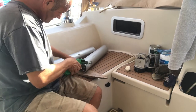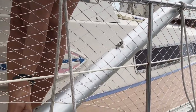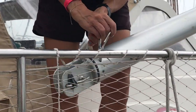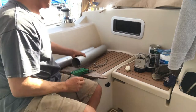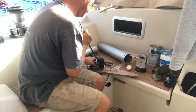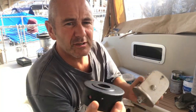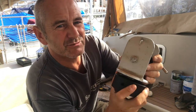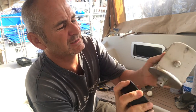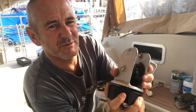Once the end pieces were off I could get to the rope which holds on the hook. The hook is for hooking on the poles to keep the spinnaker poles off the deck when they're not in use. While these are off, I'm going to widen the hole on the end piece because the roller on the end doesn't actually twist — it's really stiff and doesn't fall in line with the sheets. So I'm just going to widen that hole by a millimeter or two to make that movement a bit freer.